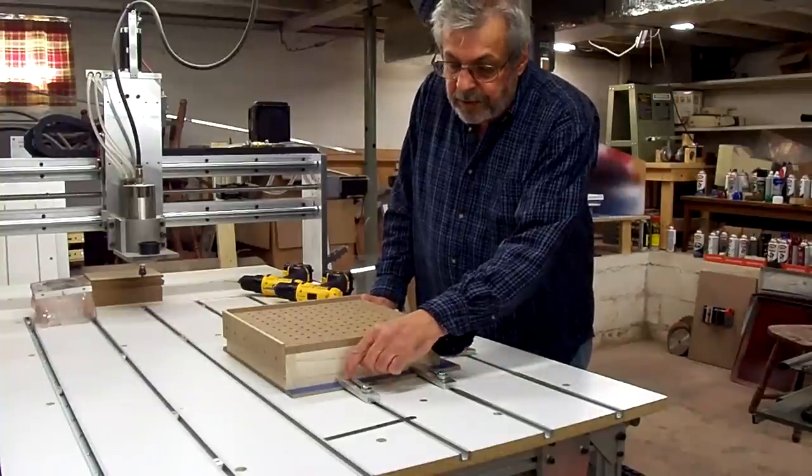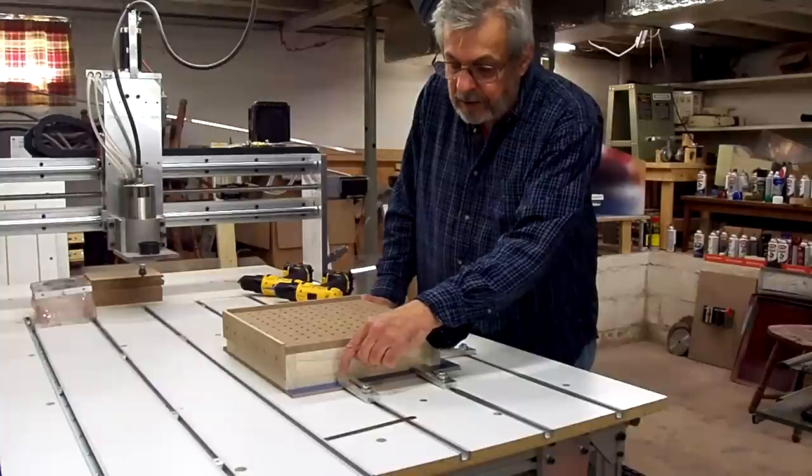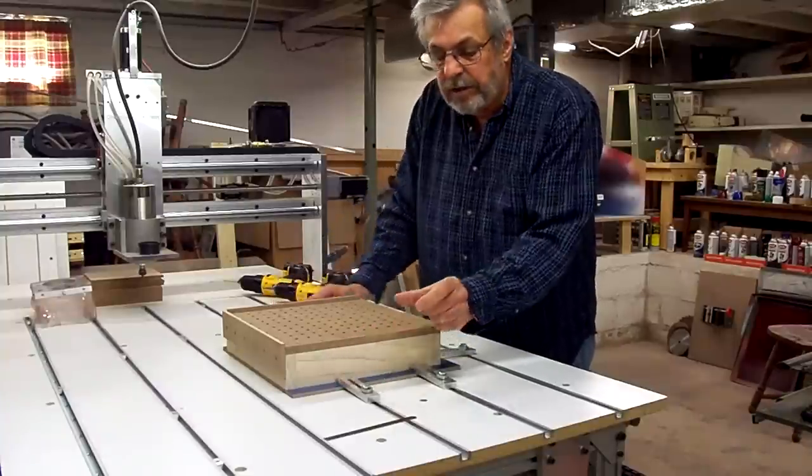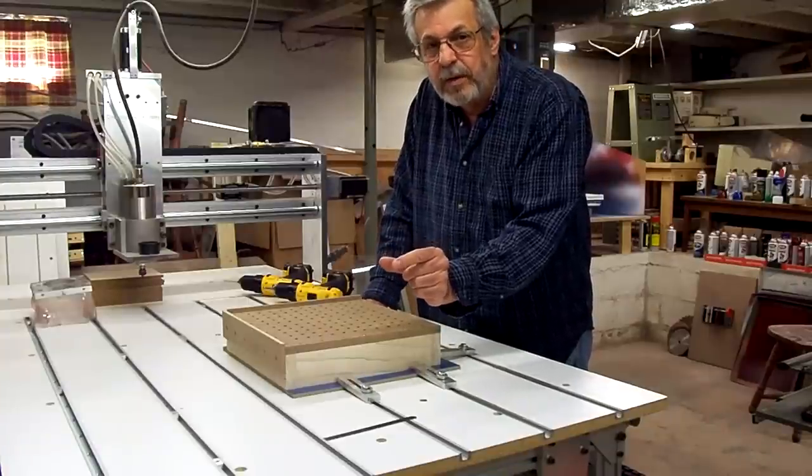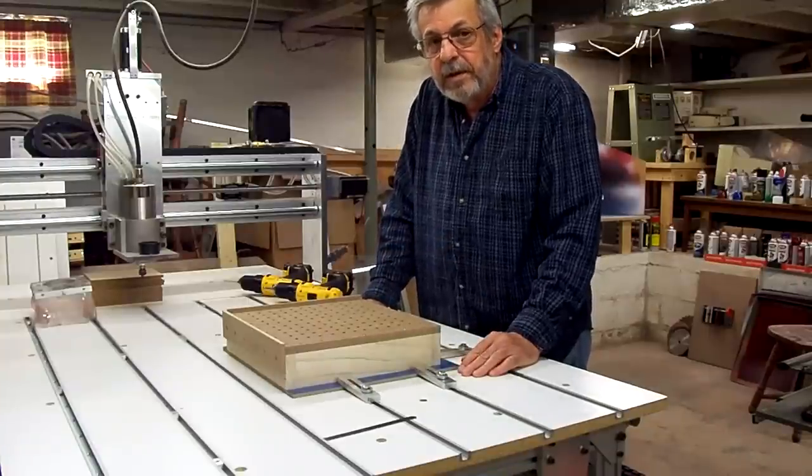So we'll put two little small screws through the bottom on each end into two little small pieces of basically a key made out of aluminum, which will be drilled and tapped.